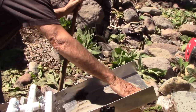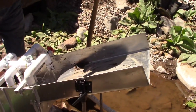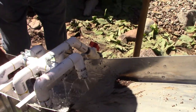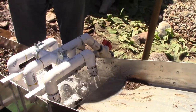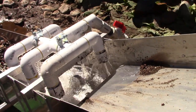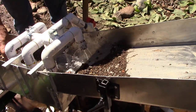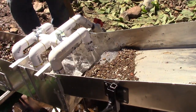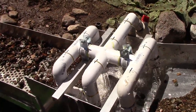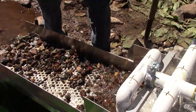This piece of equipment runs real close to that of a dry washer in that you load it up and work it off a little bit. Now we're scraping off the front of the punch plate. As you can see from this angle, you can see the material just above the nozzle staying there. I need to do something with the nozzle to get a little bit of water spraying up on that to help wash it down.